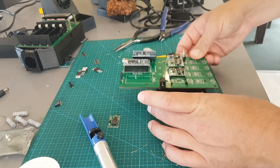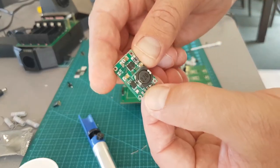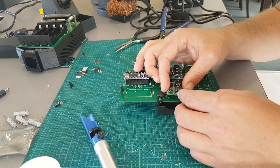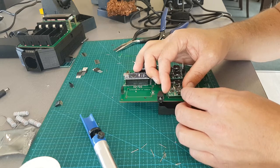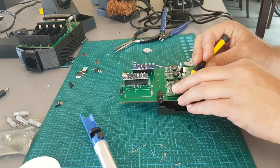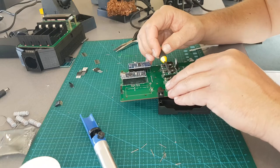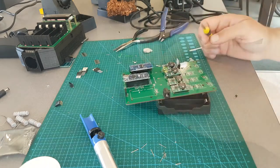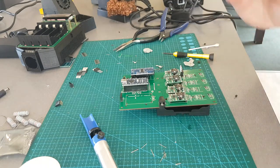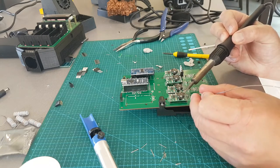I've just got this case — I'll just put it over the top of that. I'll grab the TP5100. Make sure I've got the charge pin down there. I'll do that one first. Got to get line two lined up. Then just use a little screwdriver to position it. There you go. And the last one — so it just sits on top like that. Just tap solder it in two corners. Just be gentle — I don't want to lift it over.